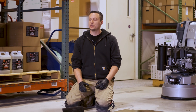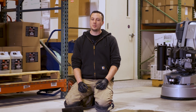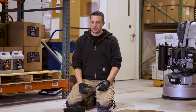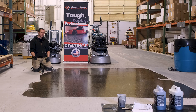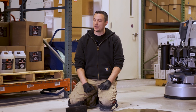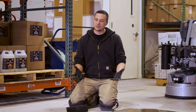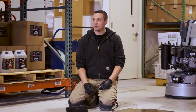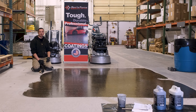The other option of course would be for epoxy floor systems — if you're trying to minimize outgassing with a neat floor system or metallic epoxy and you don't want bubbles and craters in your primer or body coat, one of the ways to prevent outgassing is to do a grout coat just like this with your MVB. Rather than using a one-to-one polyurea, you're just going to use your moisture vapor barrier — for example the ResinForce Flake Shield MVB, either clear or pigmented — grout coat that at about 600 to 800 square feet per gallon, let it tack up, and then put down 16 mils of that same product right on top of it wet on wet. That will minimize as much outgassing as possible. If you have any questions, feel free to comment below or give us a call anytime. Have a good day.